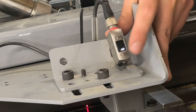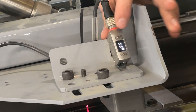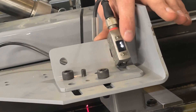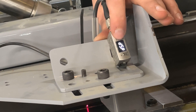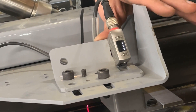Next is the clamp function — we want this to be off as well, so hit up until it says off. And now we're at the display — we want the display to be on, so we'll leave it on. This just shows whatever the sensor is reading on the screen. If you hit down, it should now say the end of your system parameters, and the sensor should be set up. You will have to reset the threshold after doing this.